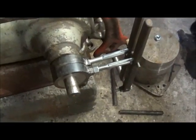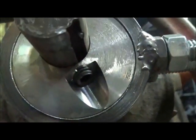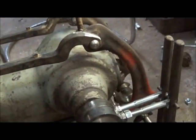Here's where we stand on our engine right now. Eccentrics are done. Let me get to where you can see it. Finished up the pieces to tighten down the eccentrics and they're just sitting on there, not adjusted in any way yet. We've machined out the slots, and as you can see, we've got the pins in — but these pins are going to hit each other, so we ran into a little problem there.